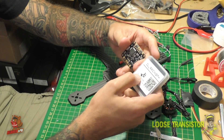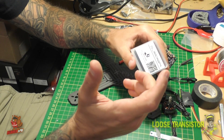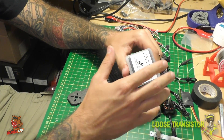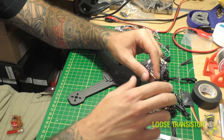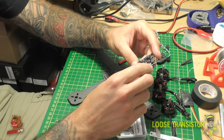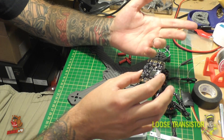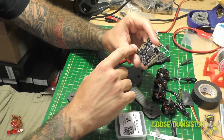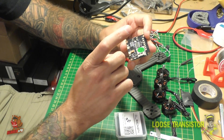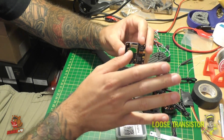The flight controller is the CL Racing F4. These guys are somewhat new on the market. I did test one of their 1600 batteries — they weigh about as much as a 1300 mAh battery but pack a lot of punch; it felt almost like a souped-up Bonka graphene and delivered full 11 laps on UTT4 pushing hard. The F4 includes a built-in PDB up to 160 amps so you can run 2 to 6S no problem. It has ESC pads around the sides, built-in OSD for Betaflight, a current sensor for current and voltage readings, and a spot for an SD card for Blackbox logging.